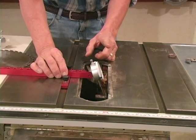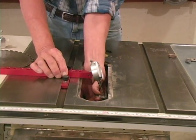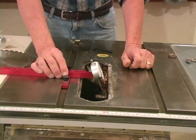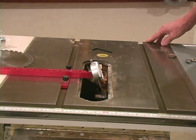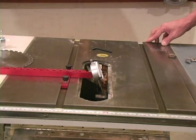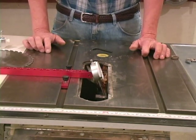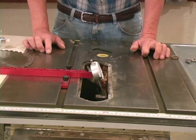The two things we can do in this configuration: number one, we can grab hold of the arbor shaft and give it a pretty good shake. On my dial indicator I'm showing about a thousandth and a half to two thousandths maximum play — and that's with me tugging on it, that looks pretty good. The last thing we can do is walk around the saw and rotate your motor pulley, which will spin the arbor without you making any contact, and this allows you to determine how straight your arbor shaft is. I don't have half a thousandth of an inch showing on my indicator when I make this test, so I know my arbor is good and my bearings are tight. This is a really nice test for those of you who doubt the quality of your saw, and it's one well worth doing.